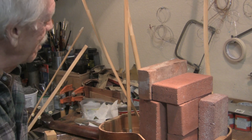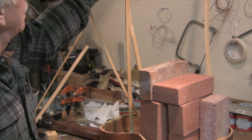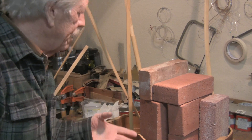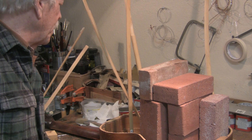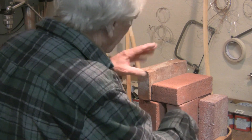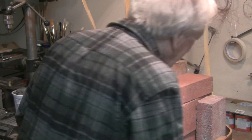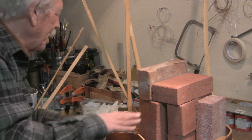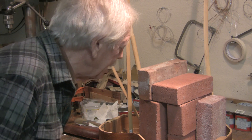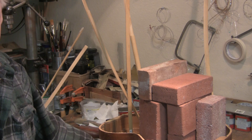Here you have the force modules. I start with these go-bars — they go up to the ceiling, bend, and push down on strategic locations. I had the bracing held in place with those, but we still have some top warpage I'm trying to get rid of. I've taken those out and placed them where the go-bars won't work. These are critically placed to be on top of whatever brace I can find. I spend time making sure they push down on the braces, and if they span two braces, I want them pushing down equally. I spent some time cleaning up glue and we're going to wait until tomorrow morning and see what we have.